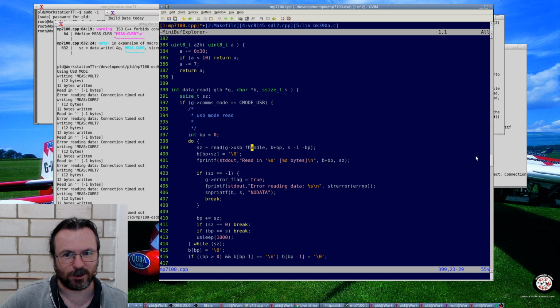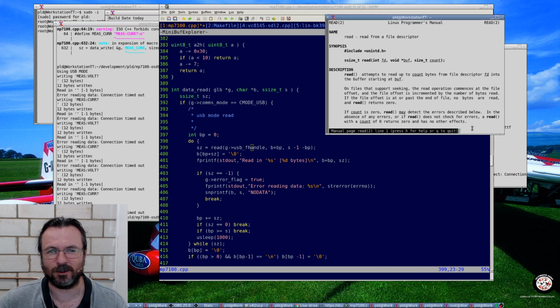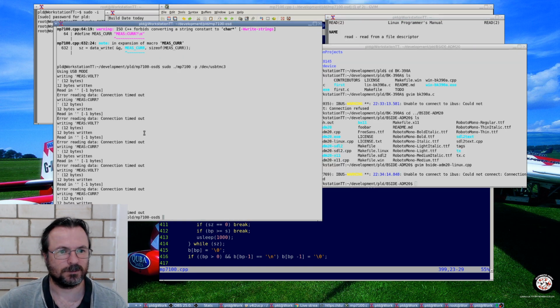Ahmed, I did, but again, I'm not dealing with serial here. I'm dealing with the USB. The serial parameters on this change only the serial port, not the USB port. And as it was last night, it was on 9600. Not last night, the night before.